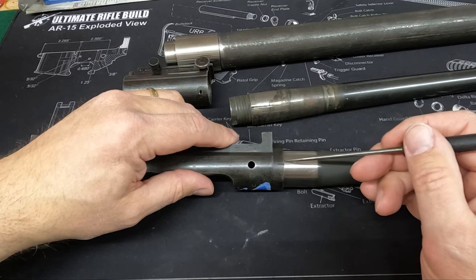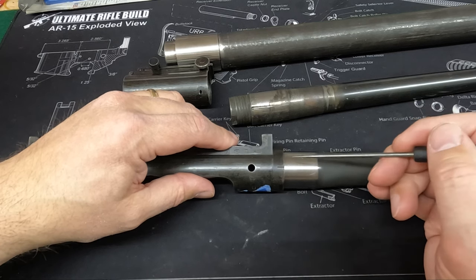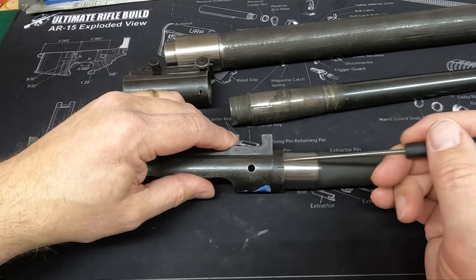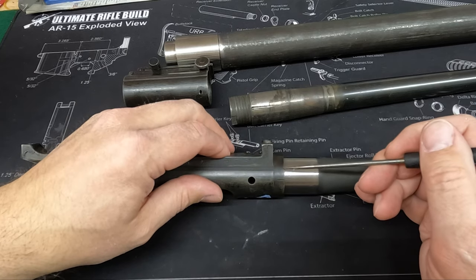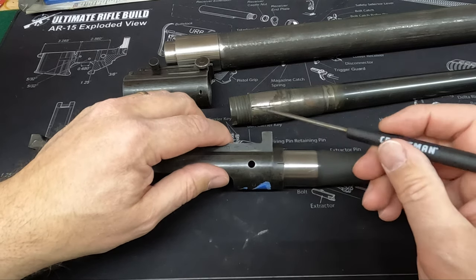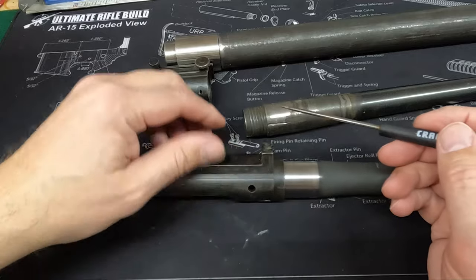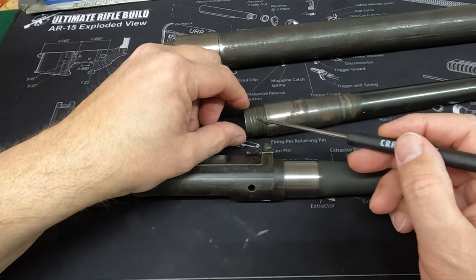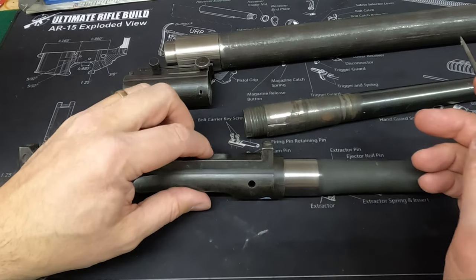When I had this at a 16th, I tightened it up with the action wrench. It just didn't have enough torque. It was clearly just barely engaged. So what am I going to do? Short of a lot of work on the receiver and perhaps even the barrel to re-time these things and move this back to where I can have more interference, I tried an AR-15 barrel shim. It was a very tight fit over the original threads, and once it dropped over the last thread and came up against the shoulder, it was perfect.